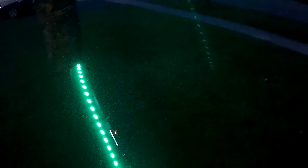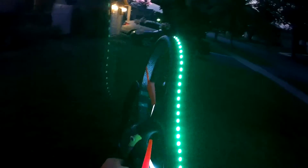So right now, just for testing purposes, I slapped in a 9-volt battery. But it's pretty heavy. So what I did is I ordered an 11.1V, 500mA LiPo — a very light battery — and it'll keep these LEDs powered for a very long time. Even though a 9-volt battery will too, the 9-volt battery is a lot heavier and it throws the balance off this thing. I like it. I think way up there it's going to be kind of nice, but I wanted to test it before the sun came up. I'll see you next time.